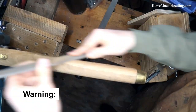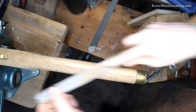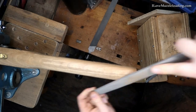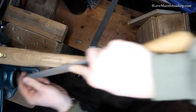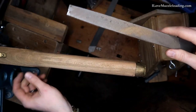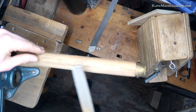I'm starting out by rounding out this corner down here — it's a very boxy stock as it comes. I don't want to spend too much time on the flat on this underside here; it's already pretty flat and I don't want to remove too much material there. I'm going to start with that initial 90-degree corner and kind of break that angle. I'm softening up my cuts as I get back here to our side plate or our lock mortise because we're going to work those a little bit — I don't want to take away too much wood there when I'm not thinking about that area.